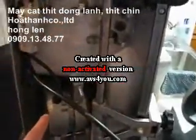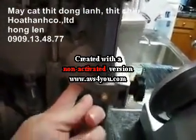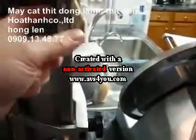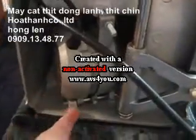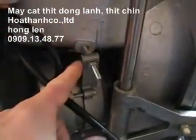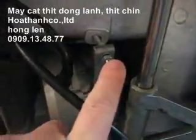Now both of these units are manual slicers. The piece here, the platform, just simply slides on the bar and against this square stock here. Now, the motor in this unit is fixed on this pivot rod, and this end is onto the cast housing. Has an adjustment. That's what keeps your tension on the belt. The big one is very, very similar.